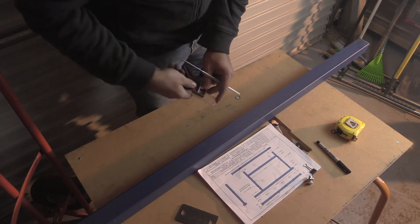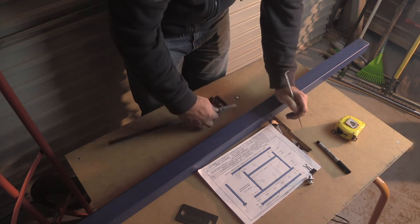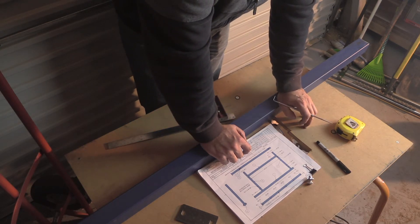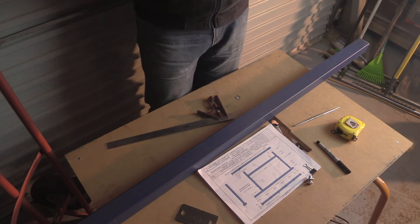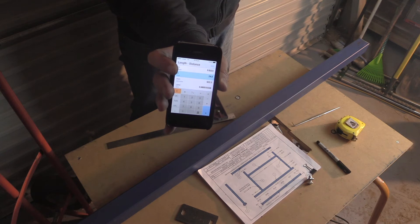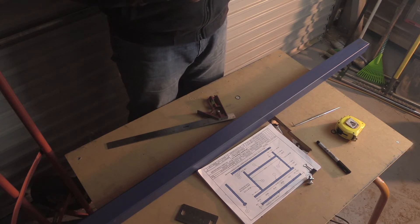Set this to just a touch under one inch. Actually, before I do that — this calls for 0.38 of an inch off the top, so I can't actually drill these in the center. That would have been a mistake had I done that. So 0.38 of an inch — I'll work it out in millimeters. On my iPhone I've got this really cool app called Converter, so I just go into inches, enter 0.38 — it's 9.65 millimeters, so we go 9.5; once I scribe that'll get me close.